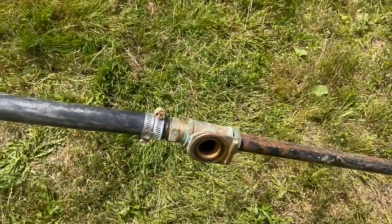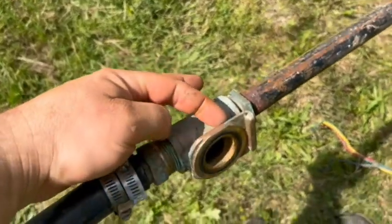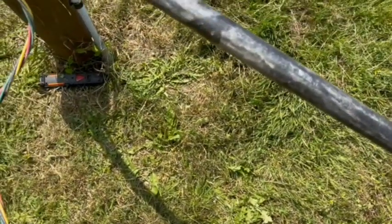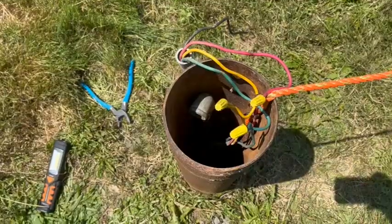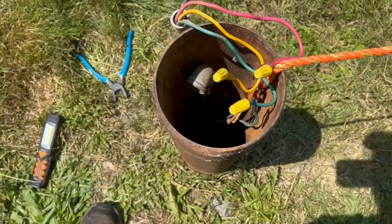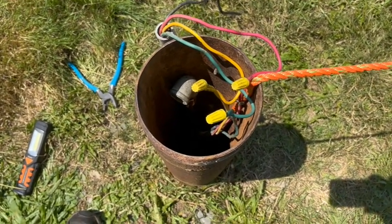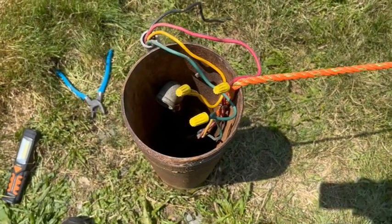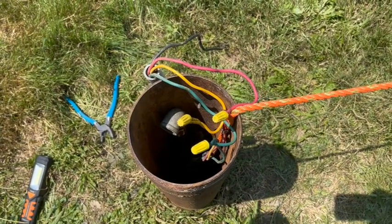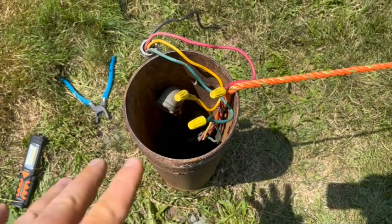So now comes the fun part, getting that thing back down in there and getting this side and the other side lined up and seated down in. All right, feels like I got it seated into the pitless. Took me about 8 or 9 shots, but the rod ain't going down, the pipe, it wiggles back and forth. Feels like it's seated.